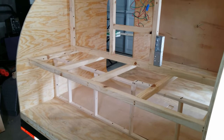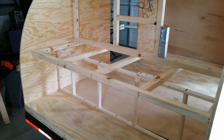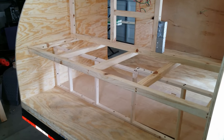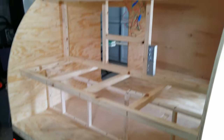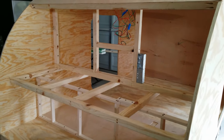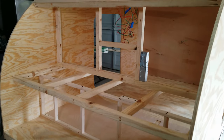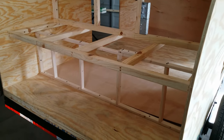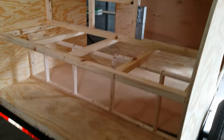If you're not going to build it this way, it's pretty simple. It's just inch and a half — the same as the roof spars I used — except the bottom section is actually furring strips. The countertop and the wall up here is actually structural, so that's why I built it out of the same materials as the spar. What they do is keep the walls from bowing out, so it was pretty important that it was built kind of stronger. The bottom was built out of furring strips for more than one reason.